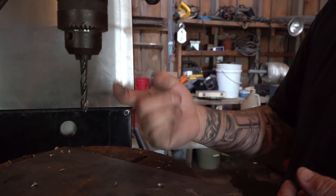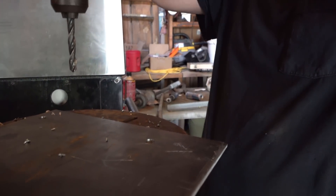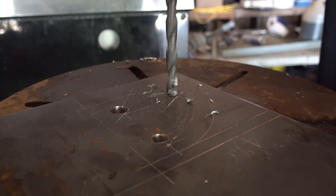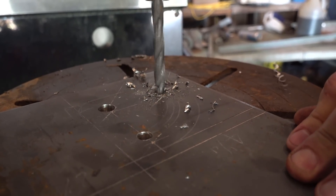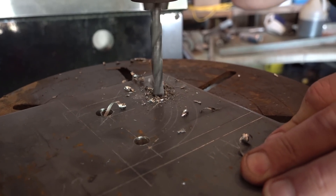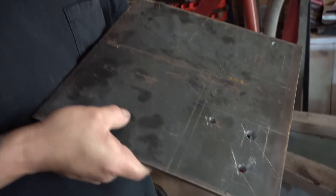Try to keep the drill as high up in the chuck as you can so there's not much tool extension to allow the tool to swivel around when it touches the center punch. There it is. In this particular part it's really kind of hard to tell, but that hole turned out really good. Chips come out of both flutes, which is mainly what you're after. If you have a drill point gauge to set this with, you'll notice that the drill chips will come out perfect every time.